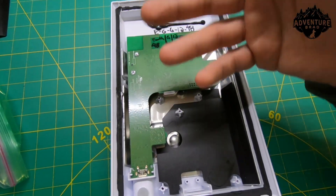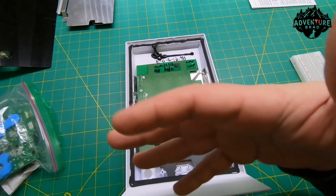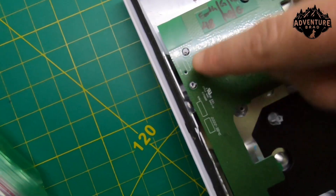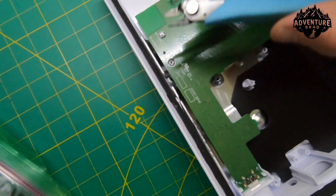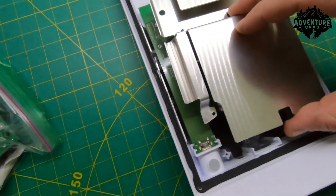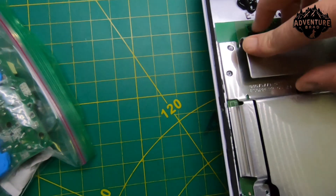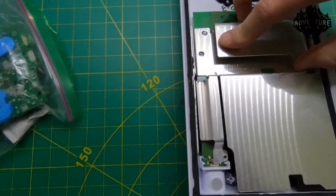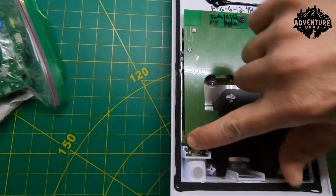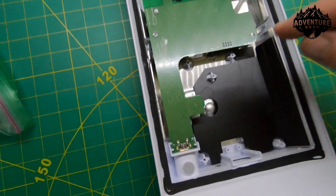I tried to work fast while it was still hot but carefully got some plastic wedges under it and got the glass lifted off. Then there are some studs — I drilled those out with a drill, then took side cutters to cut them. It's pretty easy because there's a plate that protects you from damaging anything. One spot is a little sketchy to reach into — you have to cut this little nubbin loose, pop it off, and get the board out.